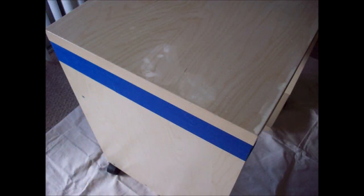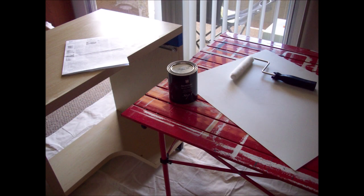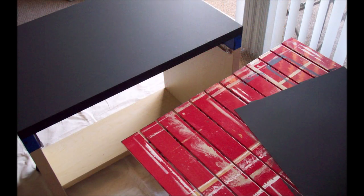I taped off and sanded the surface using a 150-grit sanding block by hand, then thoroughly wiped it down and checked to make sure the sheen was completely dull. I pulled out the iron core black primer that comes in the Gianni kit. I also started out by practicing on a sample board — I like to use large plastic sheets cut down into four pieces so I can test the finish before applying it to the furniture piece. The primer went on really solid and smooth with no raised bumps.